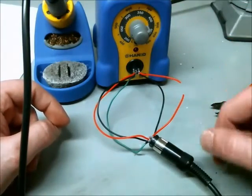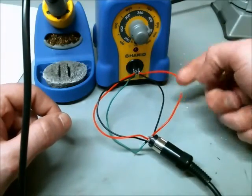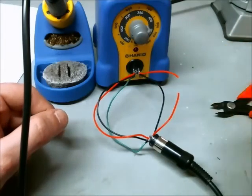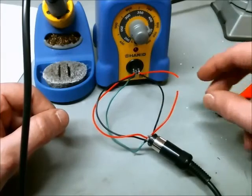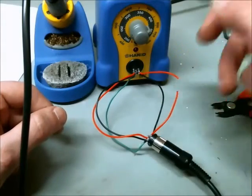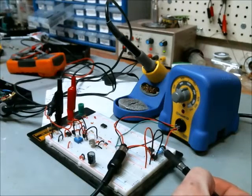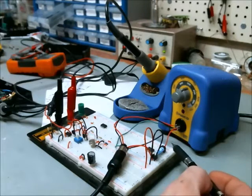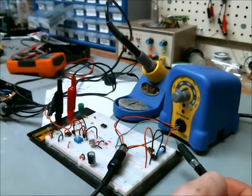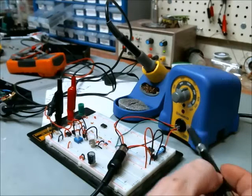You can accomplish that by using a relay. I'm sure you could achieve it with some form of solid-state device as well, but I'm going to use a relay because that's the easiest component to get a very low-resistance contact. I determined that a reed relay is pretty suitable for this application — the voltage is 2.9 volts DC and the current is 2.6 milliamps, so the reed relay will be adequate.